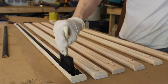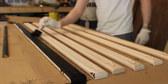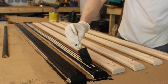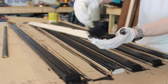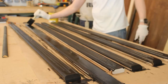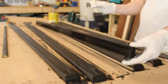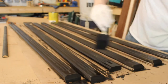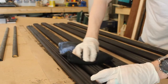Anytime that you plan on staining something dark black, make sure to wear all white. It's the smartest thing you can do. But seriously, I went through and I stained everything all deep black and I made sure it got inside of all the grooves and crevices, and flipped it over and made sure it was all a nice even coat. Then I let it sit for about 20 minutes. When that was done I came and wiped it off with the towel and made sure it was all rubbed in really good. I let it sit overnight for about 24 hours and then it was ready for spray lacquer.